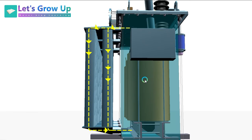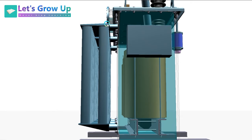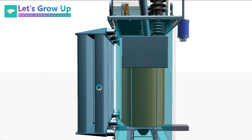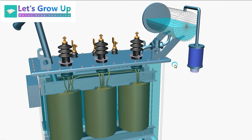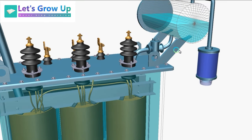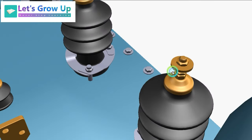The hot oil inside the tank passes through the radiator pipes. As the oil travels through this long distance, it automatically reduces in heat and the oil is cooled again. This cycle repeats again and again inside the radiator, which is why it accelerates the transformer cooling system. The conservator tank also handles oil expansion, but if there is any danger level, the radiator works alongside it.